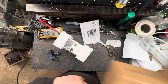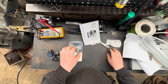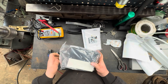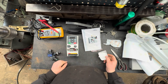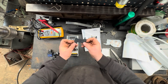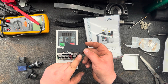It comes with a manual, which is good — the Parker ones sometimes don't and you have to go online. It's a nice inverter — only 1.1 kilowatt. That's the inverter there — pretty standard really. PB there is for the braking resistor. We can break the little cut-outs out of that end plate — the protective plate. I'll just zoom in a bit so you can see what I'm talking about.